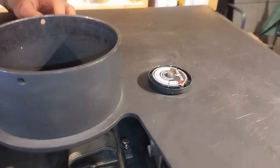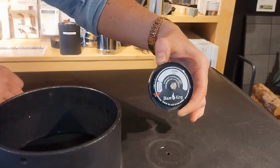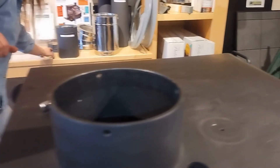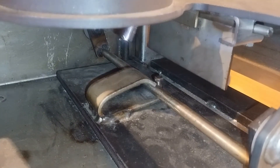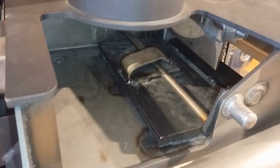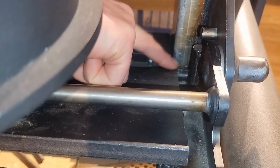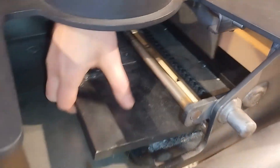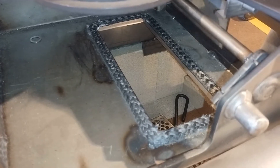Now we're going to talk about removing the bypass door for service of the bypass gasket. First, I like to take out the probe thermometer — this is the probe thermometer telling you the temperature of the combustor. It's either 4 inches long or 2 inches long should you need a replacement. We'll remove this nut with a 7/16" socket. Now we can remove the bypass door by lifting it up and out of its hinges — its little pivot point. The bypass door gasket is 5/8"; you'll need about 3 to 4 feet of that.